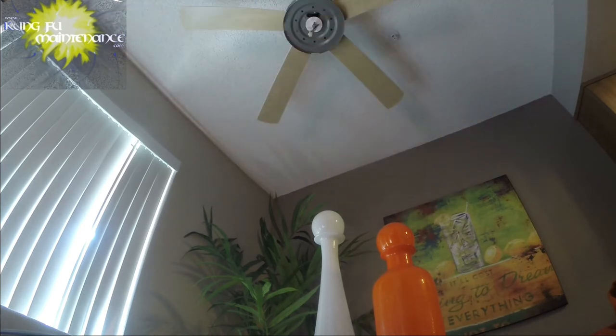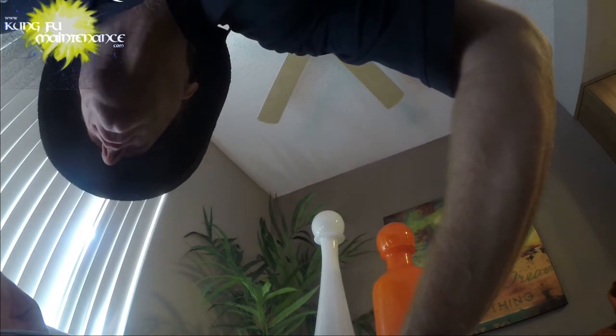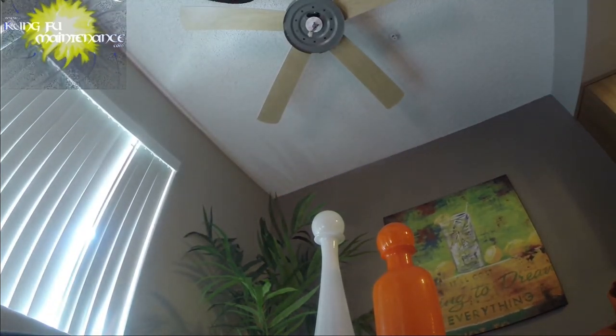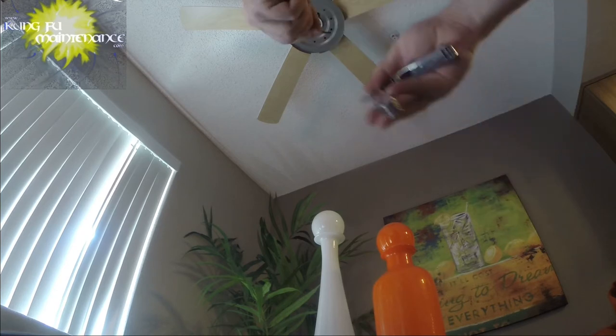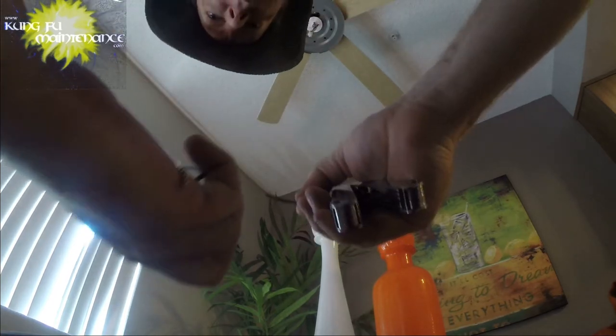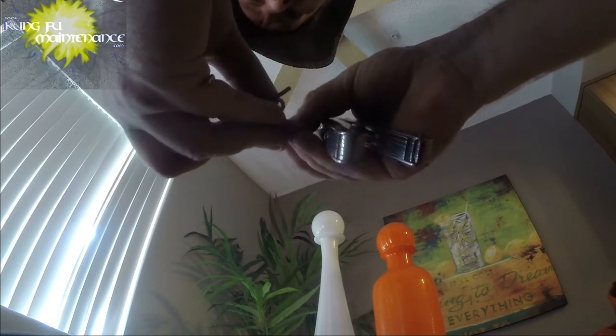Here's our switch, so I need to strip these off. Which end here. And I guess I could have messed with the directional switch, but I don't think it was that. It was switched all the way one way. Sometimes if they're half switched, that can be an issue. This one, the brown wire came all the way out of the brown peg. Can insert back, hopefully.